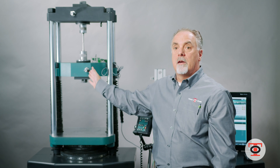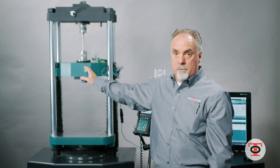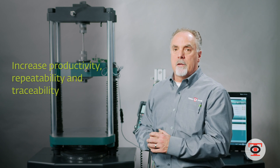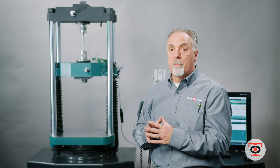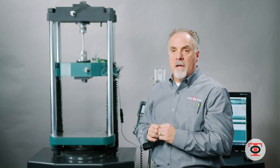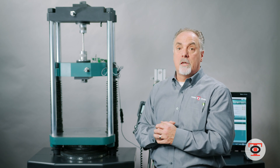With the SL line, you also have the ability to add automation to the machine, meaning that you could have a robot put the sample in. The grips can close hydraulically or pneumatically around the specimen and break the specimen with automatic extensometers and hardness machines incorporated, doing your whole complete round of testing without the operator having to put his hands in the machine at all. The robot does all the work.